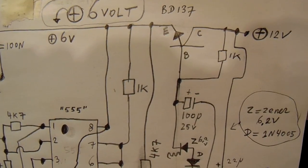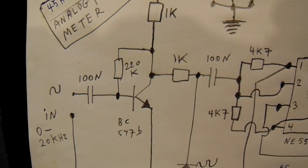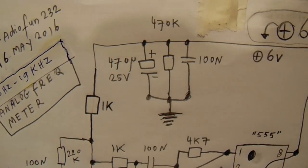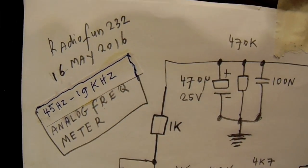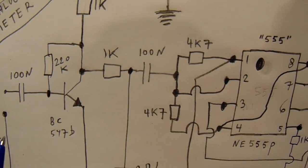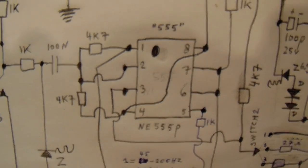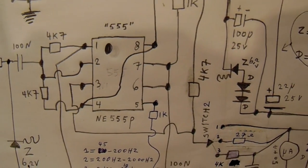Let's pan over the circuit. First, the power supply is made with a BD-137 and delivers exactly 6 volts to the circuit — you need exactly 6 volts, otherwise it doesn't work. The first transistor is the pulse former, a BC547B, which generates the pulse that drives the 555. There's a decoupling unit with a 470 microfarad capacitor. The frequency comes in, goes to the 555, where it is translated into a current proportional to the frequency.